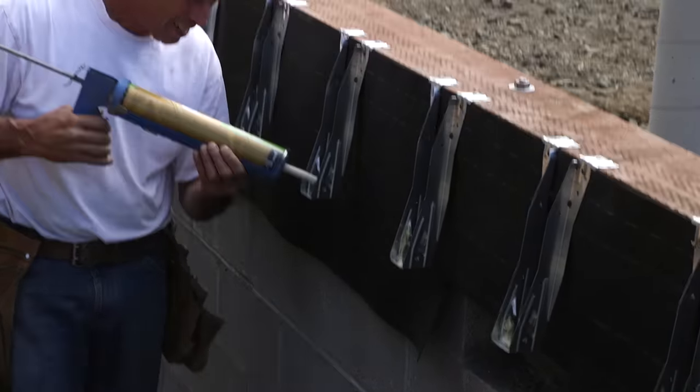Hold it. One more. That's it. My friend Steve, who's helping me today, in the crawl space, is tapping the shims into place to raise the individual joists as needed. I'm up on top, looking very closely at this string line, and sliding a little piece of 3/4-inch plywood, a gauge block, in and out to tell him when the joist is exactly high enough and not too high. I want the block to just touch the string as it slides under the string.